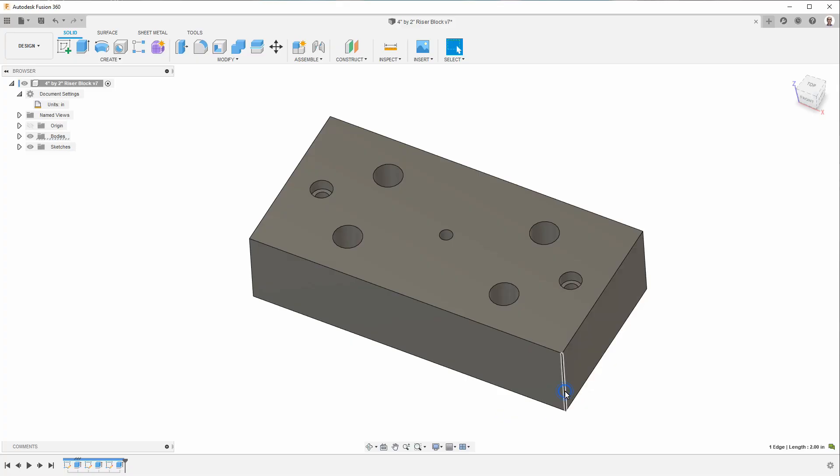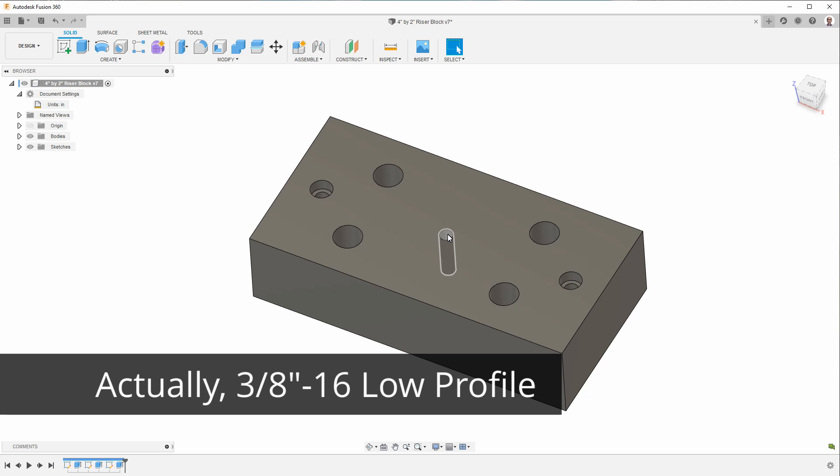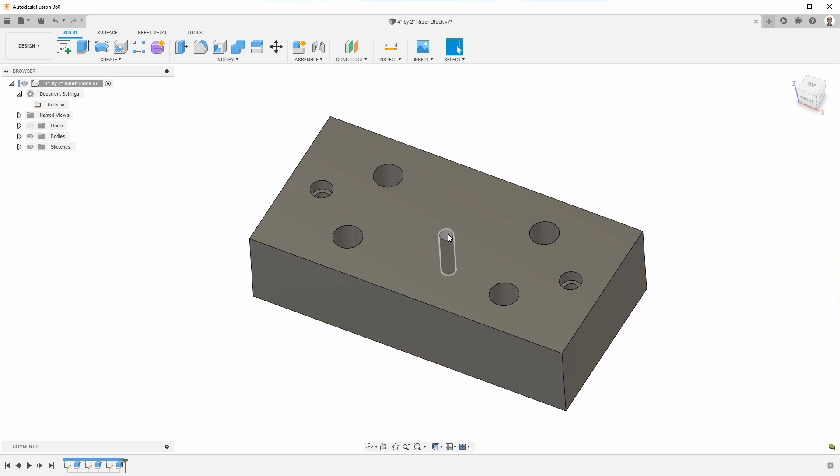This is using a 2-inch thick block of aluminum that's 4 inches wide and I made it 8 inches long — the plate is actually about 8 and a quarter, so I could have made it that. I have the two 2-inch long 5/16-18 screws that will hold it in place in the correct location. We have the clearance holes for the ejector rods. And then there's a hole that I'm going to tap 5/16-18 for the locating screw, which is a low-profile cap head screw.